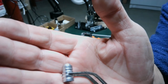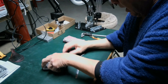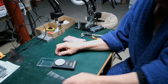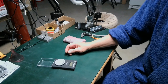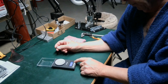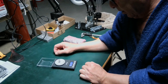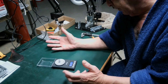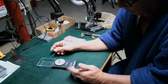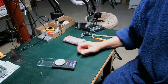Here we go. This mold comes in — I'm pretty sure they make it in a 150 and a 160 grain version. I'm finding people saying it's like 148 and 158 grains in lead, but in zinc it's 95 grains. I've read a few reports: between 95.3 and 95.7 grains.